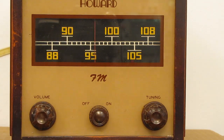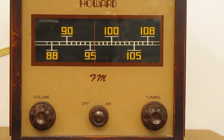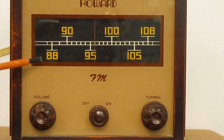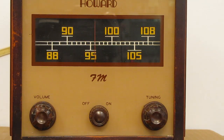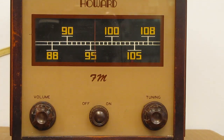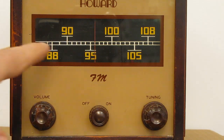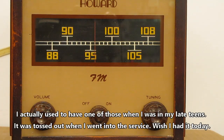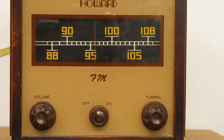I should mention, if you're looking around in the flea markets for FM converters, make sure you get one that's in the 87 to 108 range, or 88 to 108 range. Initially, back in the late 40s, when FM first came out, when Armstrong first started making sets and Sarnoff was selling them and cheated him out of his money, they were in the 42 to 50 megahertz range, which is low band VHF used for public service and police these days. And channel 4, I think, had sound in that range. I forget now, it's been so long.